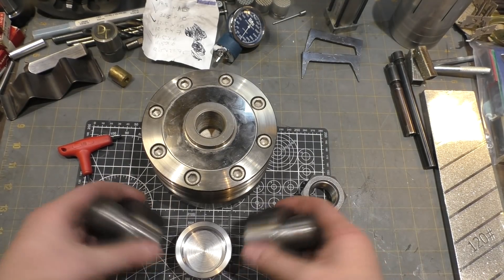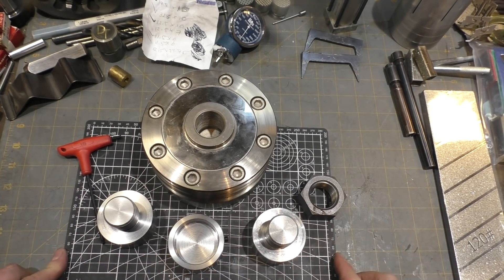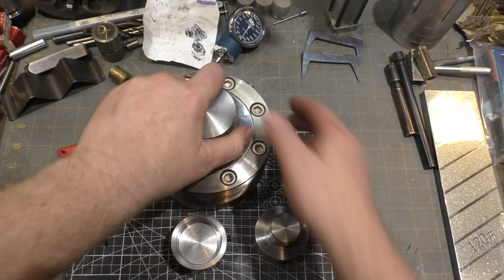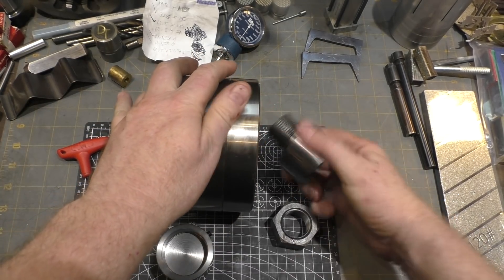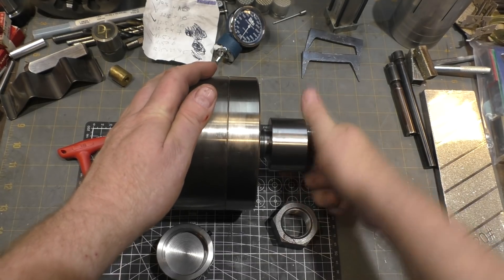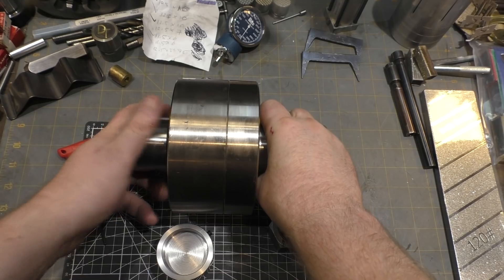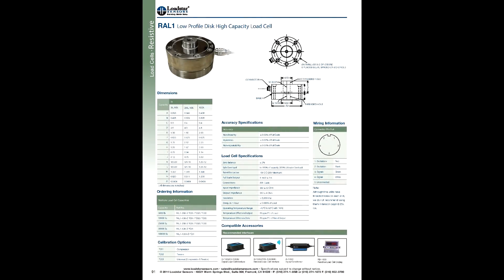We have all our parts completed now. These two are going to be the press faces for the load cell, and this one is going to be the press face for the ram on the hydraulic press, which we'll install right now. We're going to thread these down — the threads aren't actually holding the weight; it's the flanges, the face of the flanges, holding the weight. I've already played with this a little bit and they unscrew really easily. I think if you put 40,000 pounds on the threads they wouldn't unscrew so easily, so I think we're good to go. We're going to take the load cell over to the hydraulic press and put it between the press plates on the bottom and the ram.